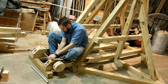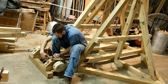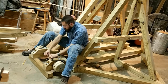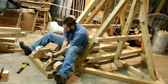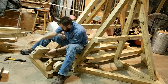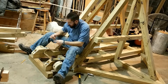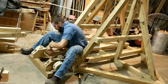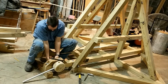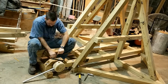I also attached the manila ropes to the winch mechanisms on these trebuchets. The winch axles are one-inch diameter steel and I was really worried the rope wasn't going to take to them well. So we ground a flat spot in the steel, and I unspliced a length of rope and laid it across the bar. I started hitching it on with a series of constrictor knots that I pulled tight with a hammer. Then I did a whipping at either end and in the middle. This actually worked really well — the rope took to that flat spot, and between the constrictor knots and the whipping, it was held on there. It also helps that the rope in the winch system isn't under tension until after about the first four or five turns, which allows it to really seat itself on the tail.